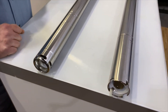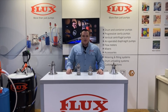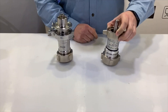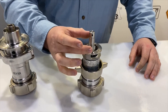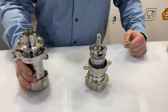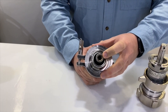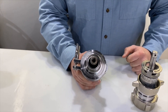Taking a closer look at the gearbox — the F550 is anodized carbon steel and the gearbox shaft is pinned. The mechanical seal is installed and then the shaft slides over and a pin is inserted to hold it all together. On the Visco Power gearbox, which is stainless steel, the pump shaft actually threads directly into the drive shaft, which creates a much stronger connection instead of relying on the pin to hold the rotating pieces together.